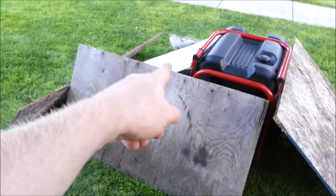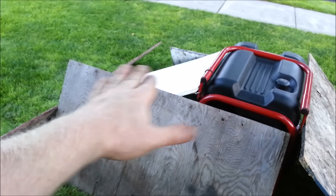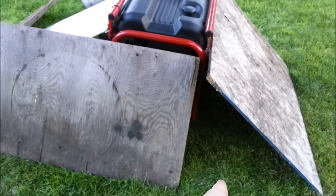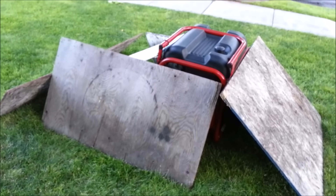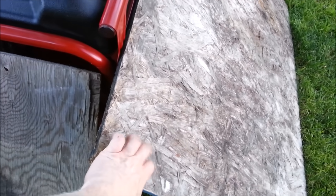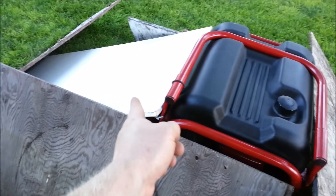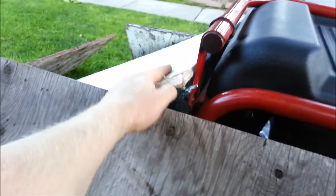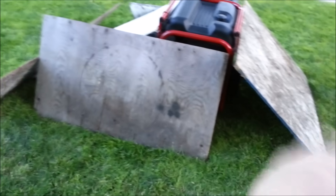So what do we got here - plywood, plywood, and that's just a piece of sheetrock. Sheetrock is nice because it won't catch fire, so that's actually on the exhaust side. But everything is tapered away enough that there is still amazing airflow. All I'm doing is directing the sound waves directly into the dirt, so they're just deflecting - that's all this is. This is something you could cut yourself: four or five pieces of random plywood. This OSB seems to be amazing at deflecting sound better than the plywood does. I've held the sound meter right side by side behind them, and the OSB and the sheetrock seem to be dead on - that's half inch, just sheetrock. I'm still getting amazing airflow under there; I'm just taking all the sound waves and deflecting them into the ground.